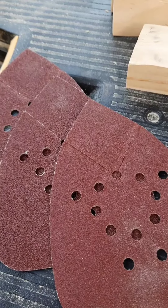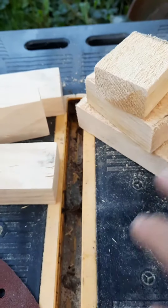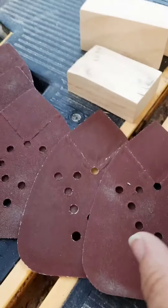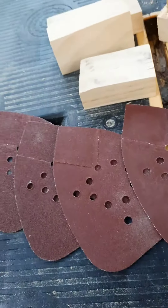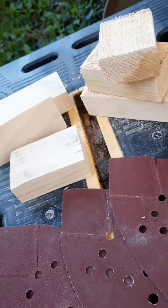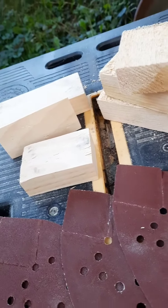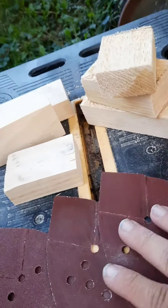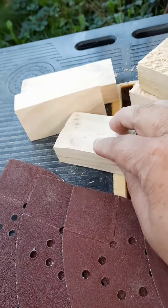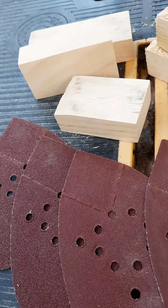The trios are all set to paint after that. The smoother finish you can get on the wood, the better the paint finish you're going to get — the paint will go on nice and smooth. A fun little insight: when people hear me say I'm sanding today, they don't think I'm just taking a little sanding block. Nope — I'm using three grits and going over these at least three times. Have a great day!